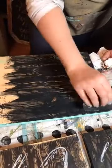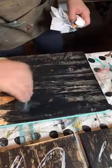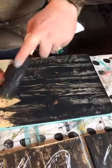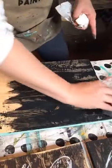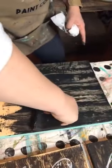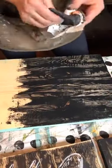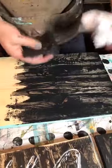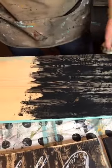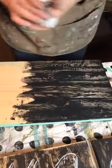It's just pretty much basically if you're left-handed or you're right-handed, right? How you do it. Go in one direction. But whether I do it this way or go down this way, it's going to give you the same thing. What's going to change it up is how long you drag it for, how long you rock it for, how long you hold in that position, how long you pull it back for, right? So if you experiment with this, you can make your wood grains really tight or longer. I mean, if I wanted to go the length of this piece, I could totally do that as well. So you can totally have fun with it, right? So hopefully that helps somebody out there, gives you guys good ideas.